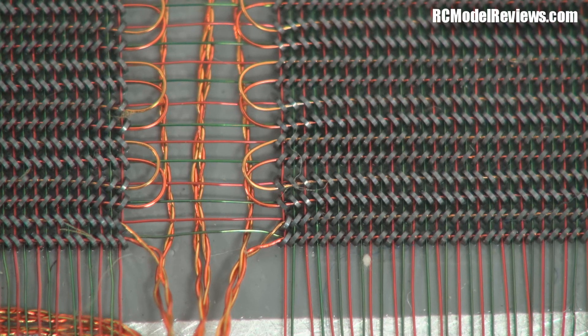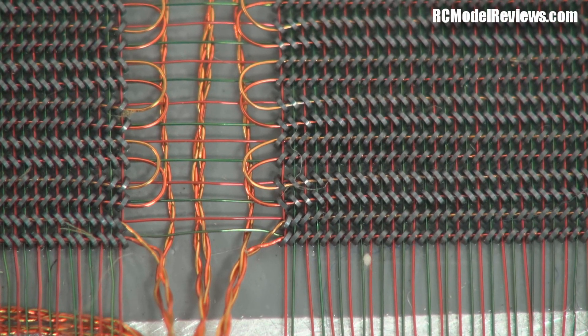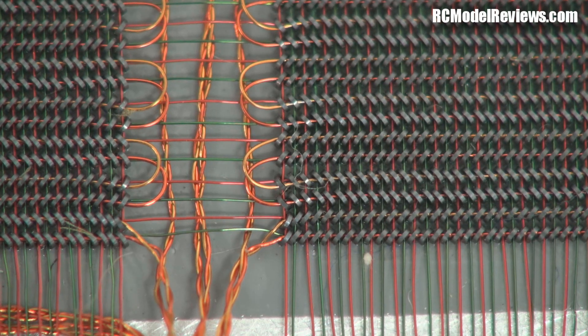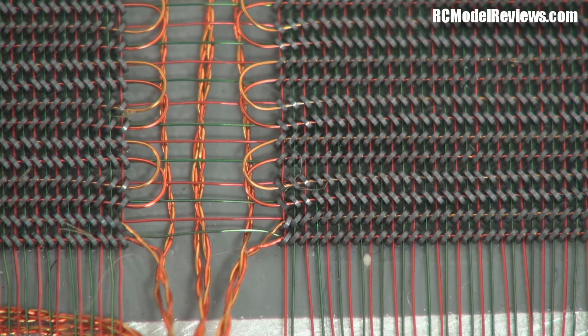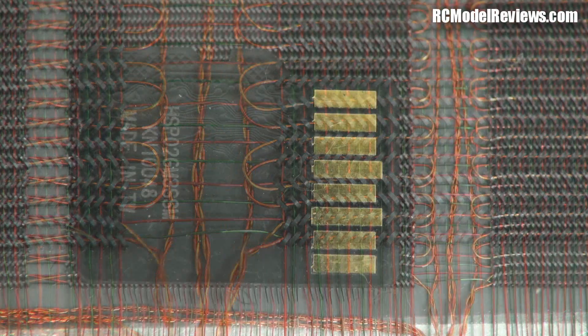These toroids are magnetized or demagnetized to represent a zero or a one. You can see the fine network of wires — there are actually several wires running through each coil. There's a sense wire which basically reads back the magnetic state, and then there's an energizing wire which basically flips the bit to zero or a one. It's on Wikipedia — I'll put a link in the description — but I thought you might want to see right up close exactly what this stuff looked like, the real thing.